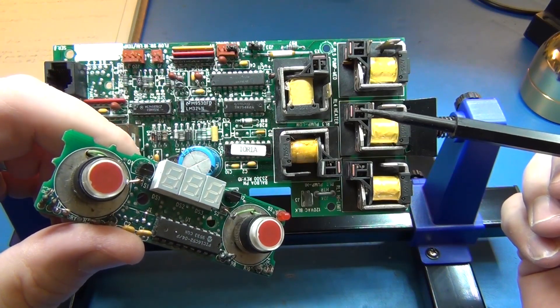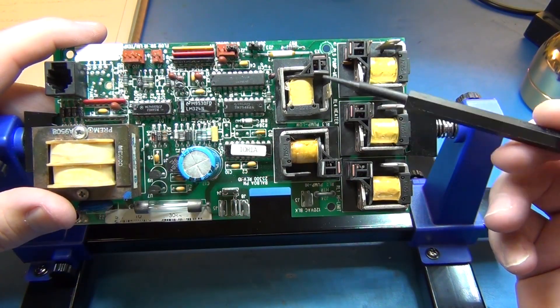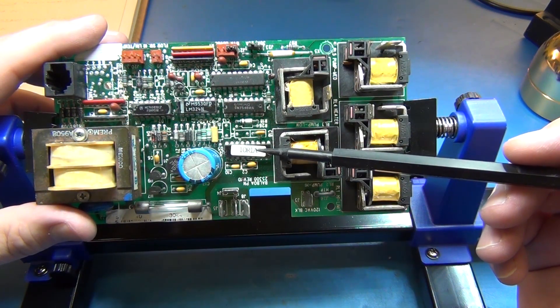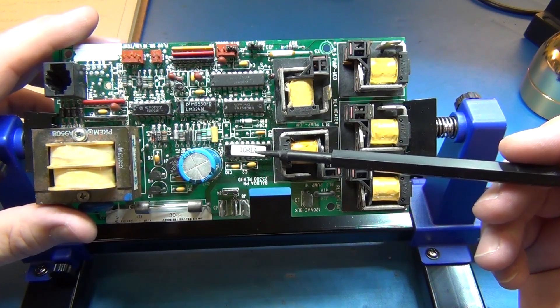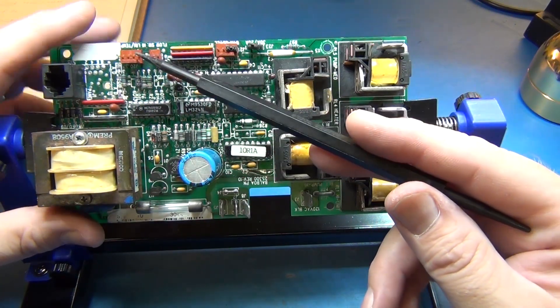Normally you would just press a button and it would go into high speed, and press a button and go into low speed. If you had to replace this board, this is the number you would quote, because that would tell the replacement board it was identical to the coding inside this controller — the program in here. And that program is monitoring these things for safety.